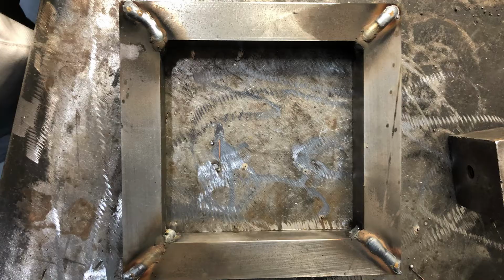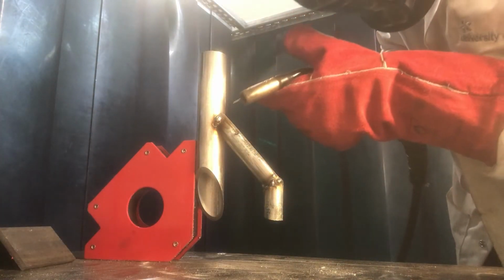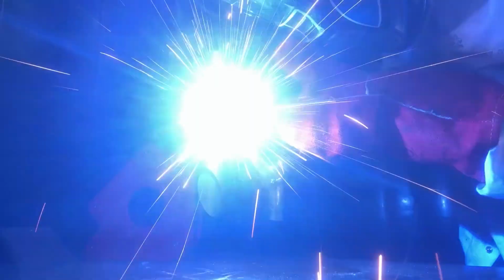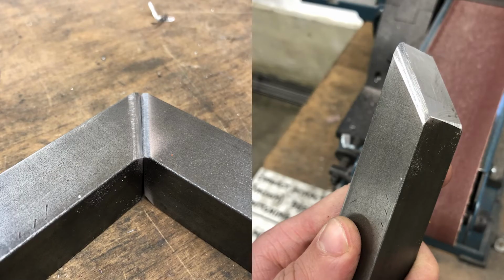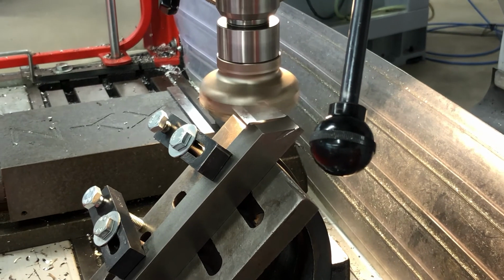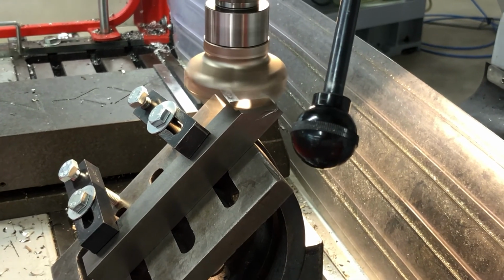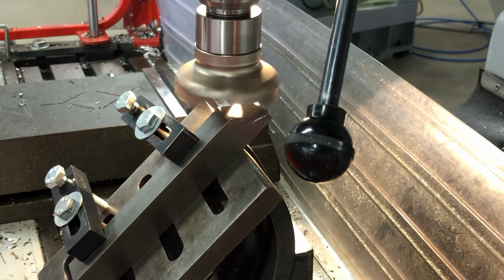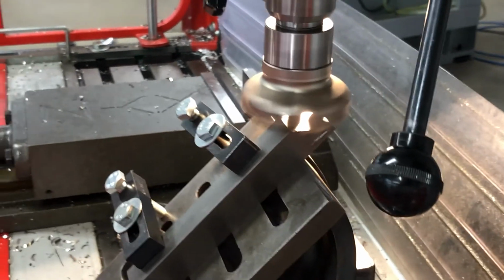I was taught about the speed and distance the welding torch should be from the part to ensure adequate weld penetration that would produce strong joints. I was also taught after my first round of welding that my welds would be much more aesthetically pleasing if I beveled the edges of the parts I wanted to weld, so I made sure to do this for all my subsequent flat welds and yielded good results. As this type of heavy machinery work requires learning to be done under the supervision of a qualified professional for health and safety reasons, the primary accreditation of my learning are the credentials of my university's metalwork technicians.